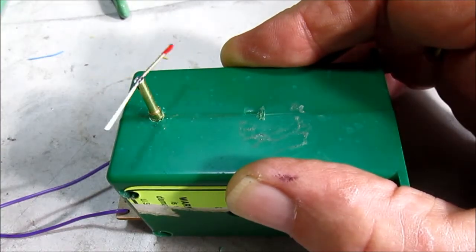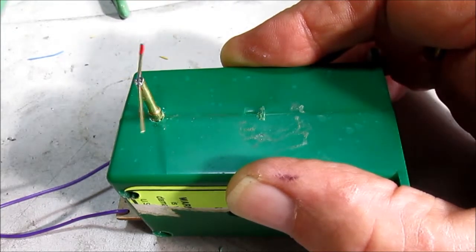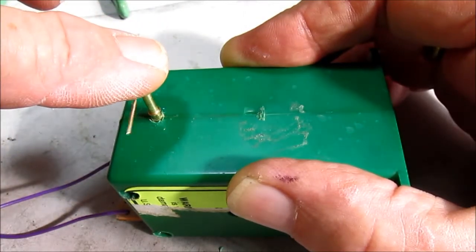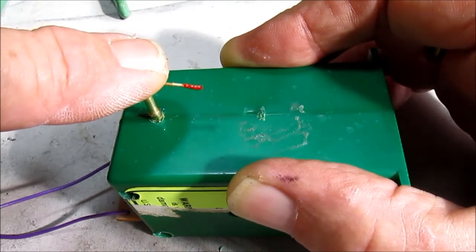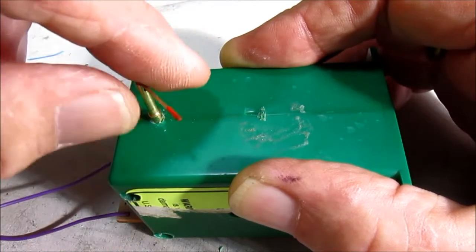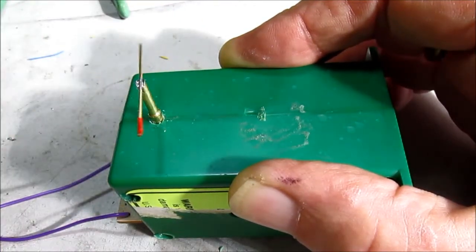We'll run it down now to 9 volts. At 9 volts it's running at 32 RPM. And again it's got sufficient power. By the way, even at this point here it's only drawing about 4 milliamps. You can stall it obviously, and current goes up to 13 milliamps.